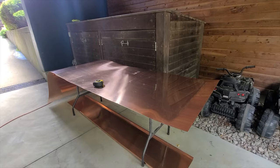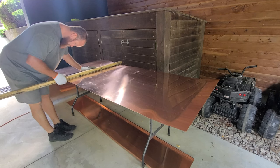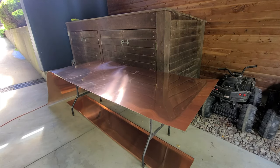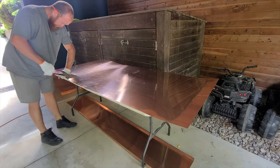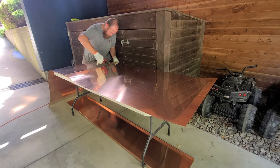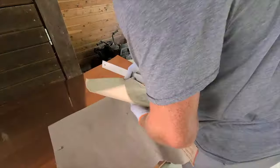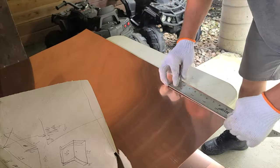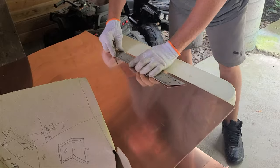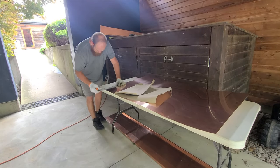Hopping into the bench and just transferring all the measurements here. This is really simple layout — the width of this panel with a 90-degree return going up the wall and then just my seam detail on the opposite side. You'd be surprised how simplistic these bends are. The prep work in trims is very basic most of the time and the bends are very straightforward. The measuring, as long as you know where and what to measure, for this part of the chimney restoration is actually quite straightforward.